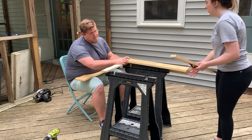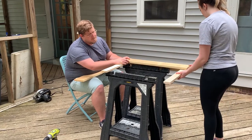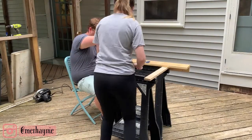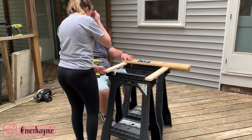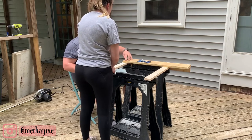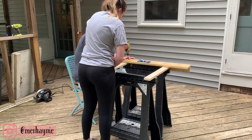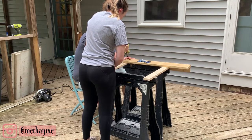Having the handles on the noodle board already made it a little tricky to turn upside down. You want to attach the 1x3 with the handles to your 1x6's from the bottom so that your screw heads don't show. I should also add that we made small pilot holes in the wood before driving the screws in with the impact driver, because this will help prevent the wood from splitting.